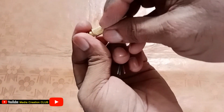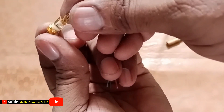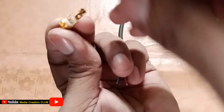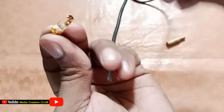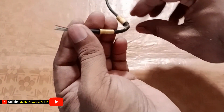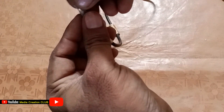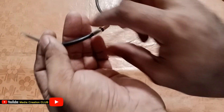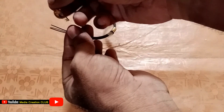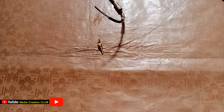Open the jack and you can find two points — one point here and one point there — and then this one is the minus. First thing, you have to put the cover on before you solder, and then the rubber as well — put all these things on the cable before you start soldering.